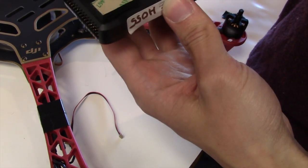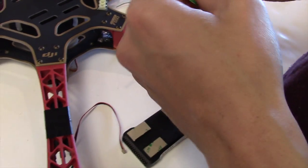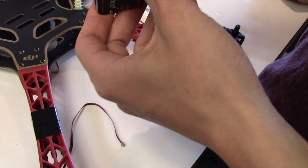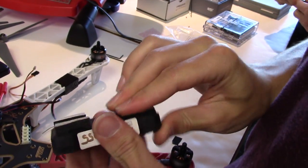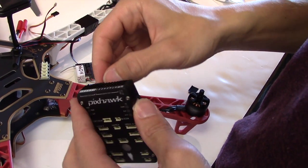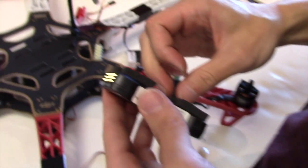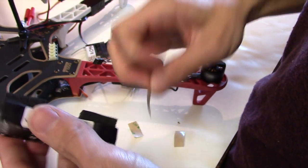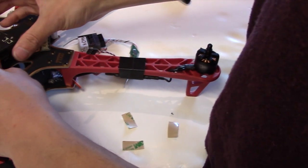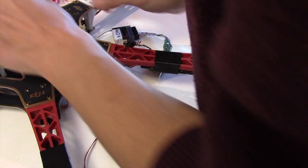You want co-location, right? Controls quals? Yeah, that's right. Explain to us co-location. It's when your sensor is not separated from your plant by a spring. Kind of, right? Why is that important? It's important because otherwise you have these lightly damped modes in your system, and depending on where you put your poles, your departure angle from these lightly damped poles, which are close to the j omega axis, might push you into the right half plane. Nice. Is that good? It's good for a professor.